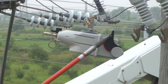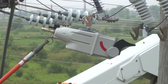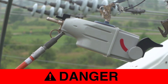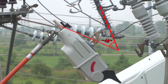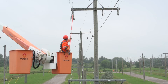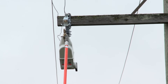You should be close enough to comfortably reach the device with a hot stick without leaning on the guardrail or standing on tiptoes. To close the TripSaver 2, place the mode selector lever in the desired mode — either non-re-close or auto — according to your company's guidelines. First, insert the straight prong of an S&C talon handling tool or a distribution prong into the pull ring. Do not put the prong underneath the pull ring. Then swing the TripSaver 2 unit to within approximately 45 degrees of the fully closed position. While firmly gripping the hot stick, drive the TripSaver 2 device closed with forward force. To avoid bounce back, maintain the forward force until the device properly closes and latches into the cutout mounting.